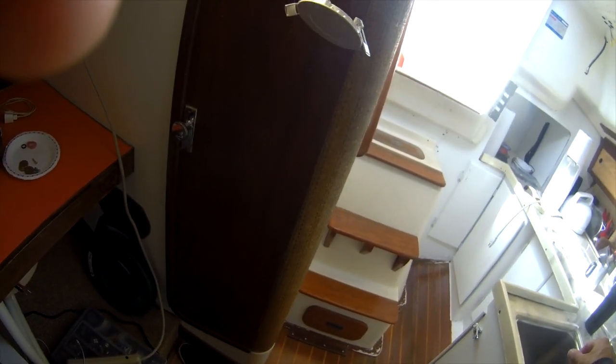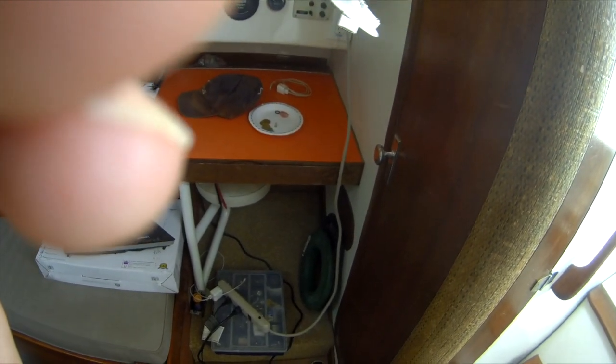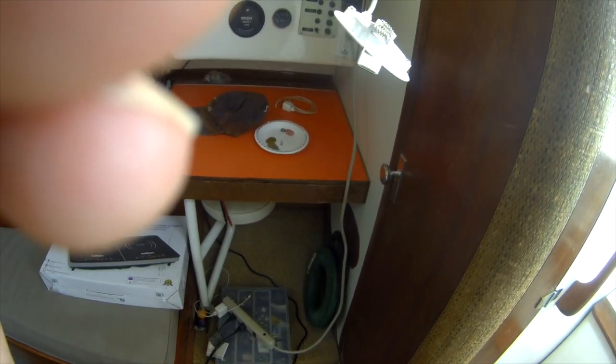Yeah, actually I am pretty happy with them. With my running lights, the bow lights, the stern, the anchor, and the mast light, I was actually drawing 5 amps, which is what this one panel can do. And that's with full sun all the time. So running my lights at night required 72 amp hours, and I only have a 100 amp hour battery. So that's my next project.